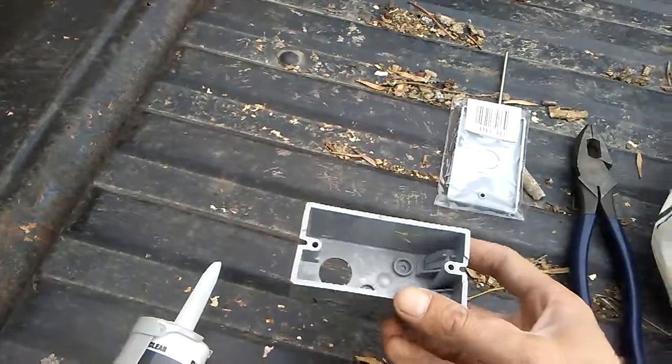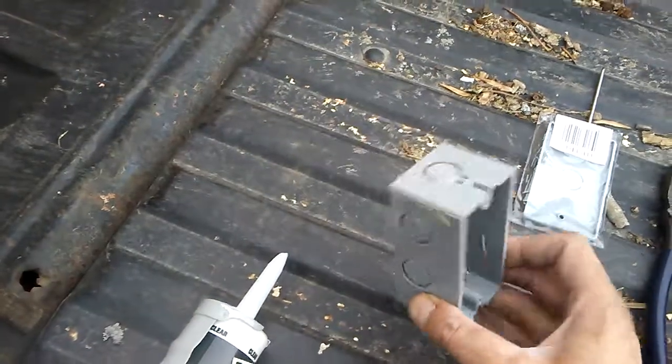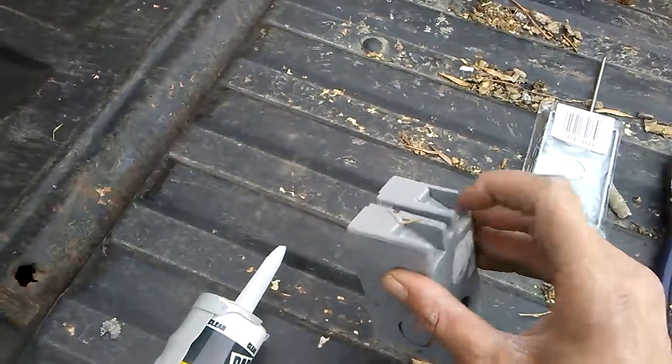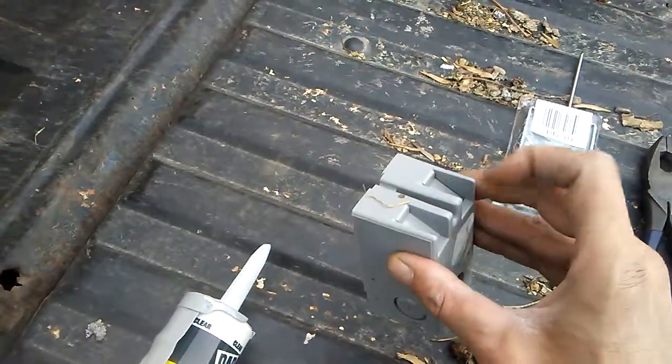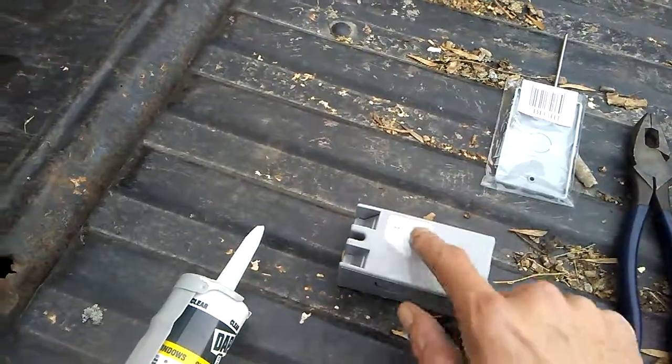This will adequately do it. When you mount your boxes and this goes up, you don't want to use the openings on the bottom unsealed. I have to silicone these right now before I put it up on top — that's another tip I want to give you guys.